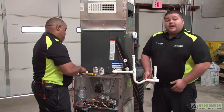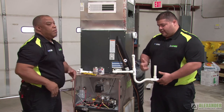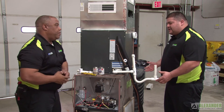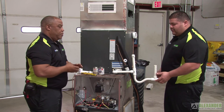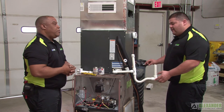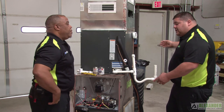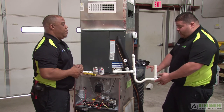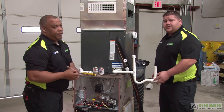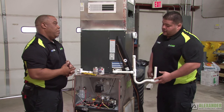That's essentially all you need to know to hook up the PVC pipe. You also want to make sure it's secured every five feet at minimum, but the best practice is every three feet to ensure a nice straight line. If the pipe bows, it can back-feed into the system and trigger your SS2 to shut off. So we want this as straight as possible with a downward slope — specifically a quarter inch of drop every three feet. That's exactly how the primary drain line is supposed to be run.